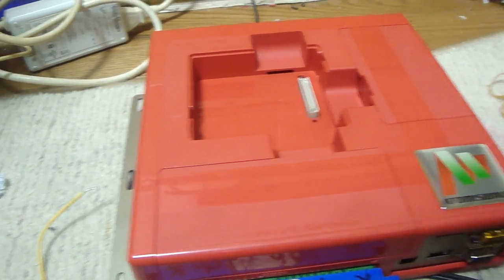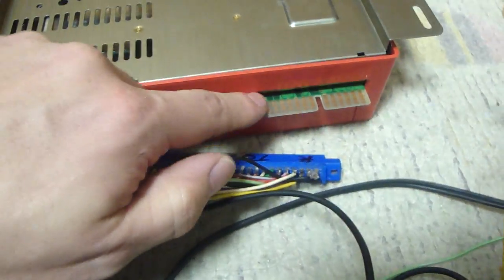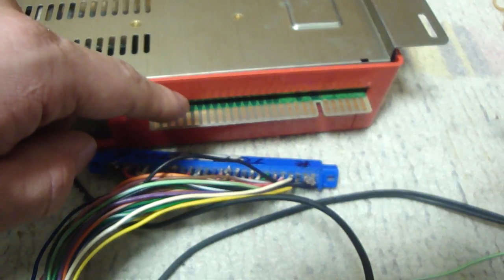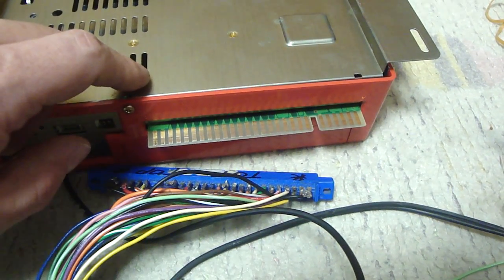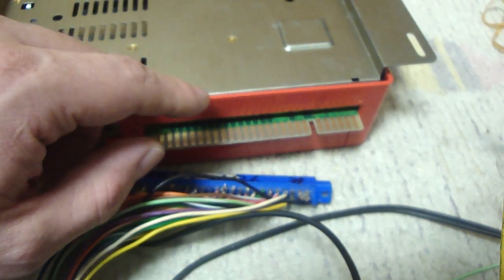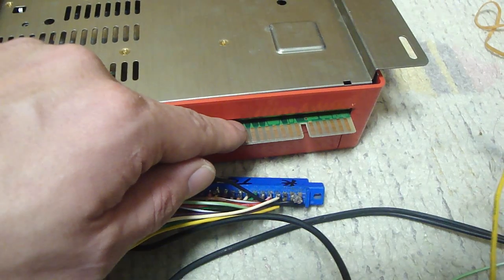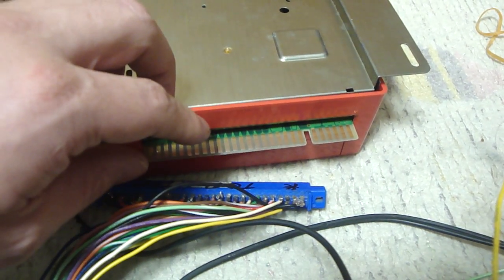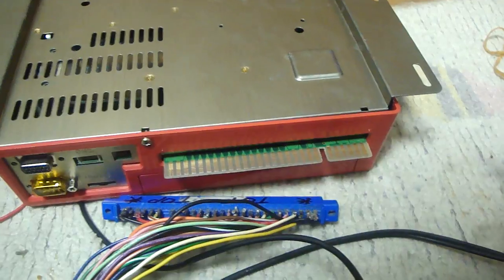And he came across a post that basically said that on the inside of these motherboards, if I flip this thing upside down, when you take out the motherboard, on the back there are many different diodes. I think there's about 7 or 8 diodes on the back here, and they're all listed as ZD1, ZD2, and so on. On a forum he came across, a guy who was having the same problem said there was a diode that was second from the right, and he didn't say which diode it was. He said to flip the board over, take the second from the right, and remove that diode. Okay, great. So I flipped it over, took a look at it, and these diodes are extremely small.